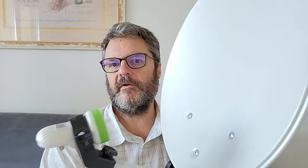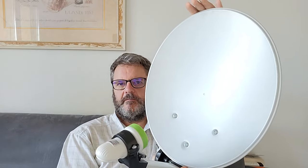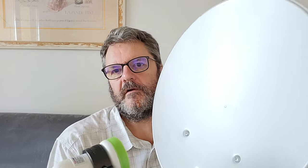Now this is a very small satellite dish — it's 40 centimeters. I'd suggest at least 60 to 90 centimeters, so that's about three feet wide, and that's much less than that. Will it work? Probably, but you might need to use a little bit more power because it's not going to — well, if you're transmitting with the dish, of course, we are going to do transmission as well, not in this video but the next one. The dish gives you an absolutely unbelievable amount of gain — I think it's more than 30 decibels.